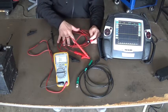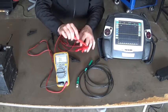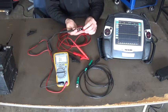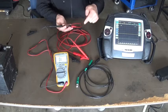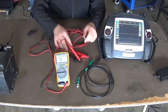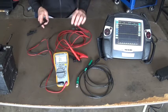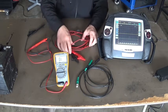Now we know they are not open, but we have to check to make sure they are not shorted. I am going to leave this lead on my positive lead and now touch the ground side on the BNC connector. We should not have any continuity and it should read OL. So now we know there is no short between the positive lead and the negative on the connector. Moving to the ground side and touching the middle pin, we should not have continuity — and we don't. So these leads are fine: not open, not internally shorted, and we can proceed with testing.